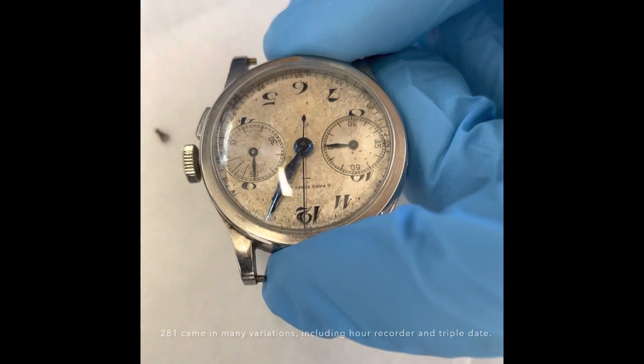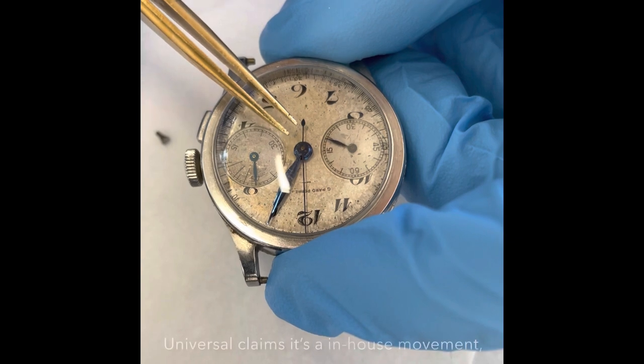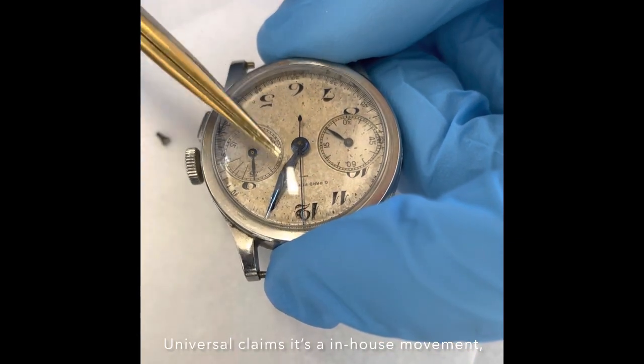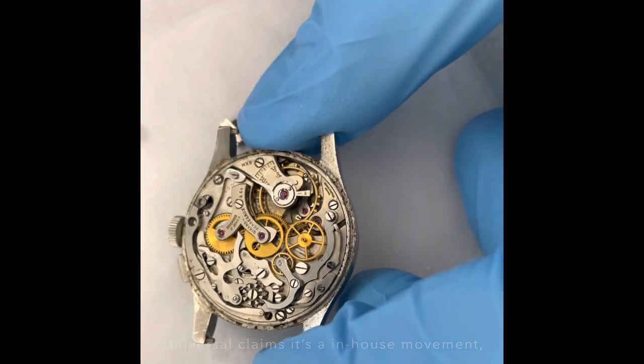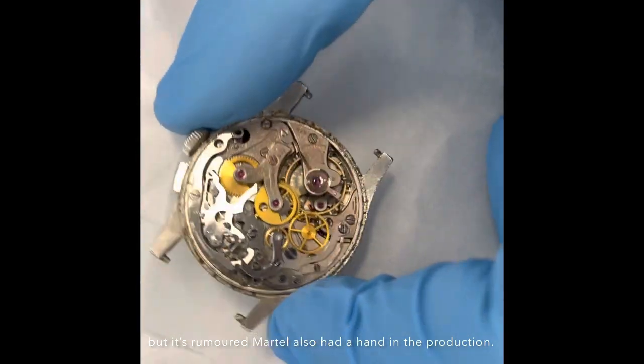I like doing the hand sideways on a chronograph, so that the hand remover feet don't touch the sub-dials, as they're very delicate. So yeah, we're going to do it like that. Now we can take the winding stem out.